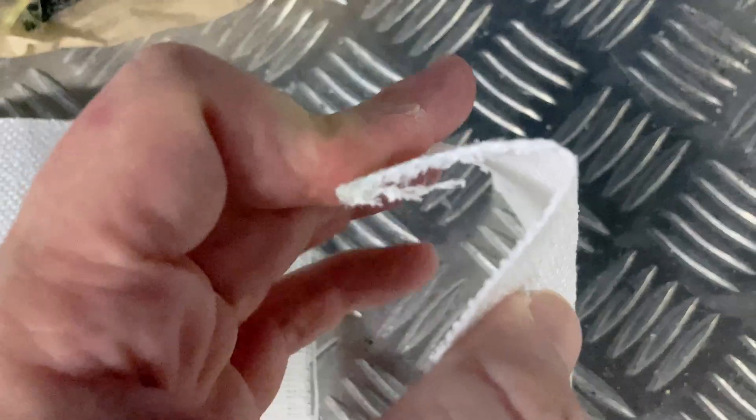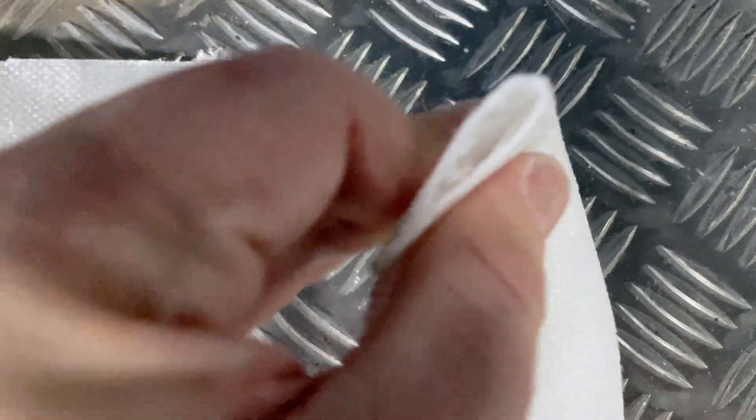A closer look shows that both halves are the same, with equal amounts of fractured resin on both. Since we now have the chance to flex a thin sheet to failure, here's a fold hard in half. The resin has failed, as probably have some of the fibres on the outside of the bend, but plenty are still intact.